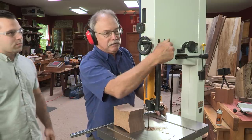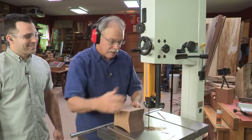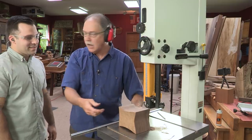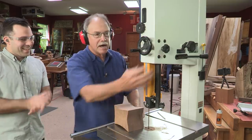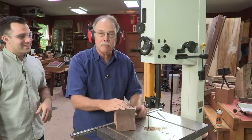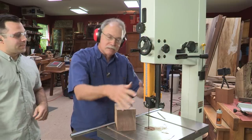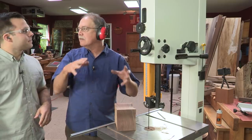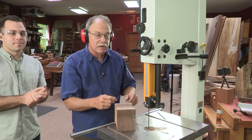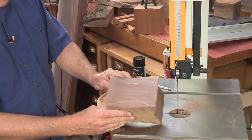Here's the thing, safety-wise — we're here with David of Popular Woodworking, and I'm Scott Phillips of the American Woodshop. Don't be reaching in there and adjusting the guide column when it's running. Make sure it's stopped. People buy a good blade, tune it up the right way, and then forget to lock that column, which makes things wonky and leads to drift. Number one reason for drift is the damaged set. Number two is you don't have it tuned up the right way.